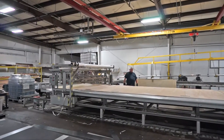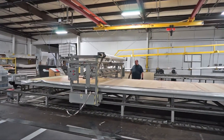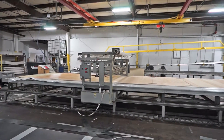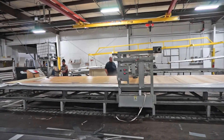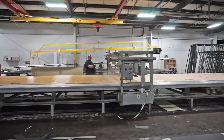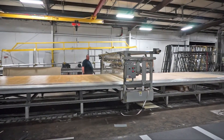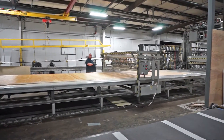We're doing a gravity drop of urethane base glue coming off the front of the machine. Off the back we're running 1.25 grams of water being misted across, activating this glue as the machine rolls on. I'm following behind the machine to make sure that we have a nice consistent glue pattern.